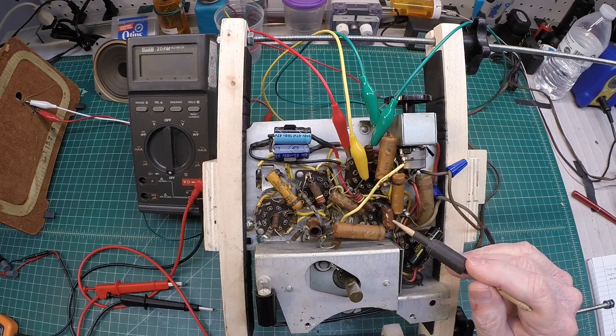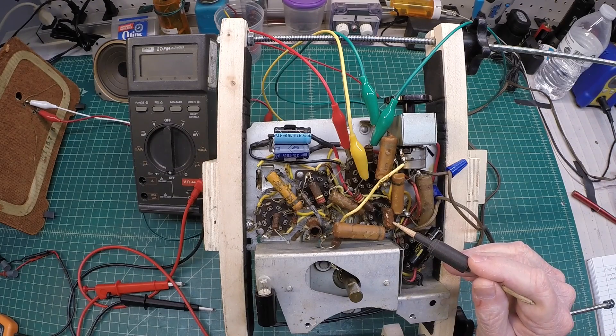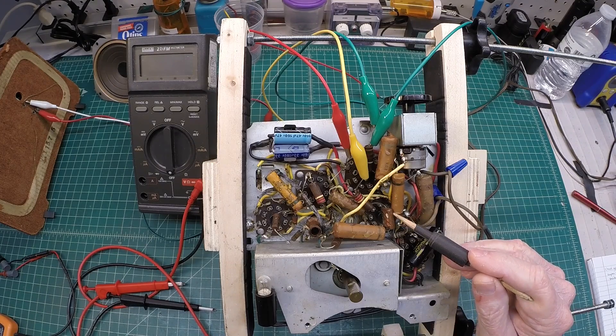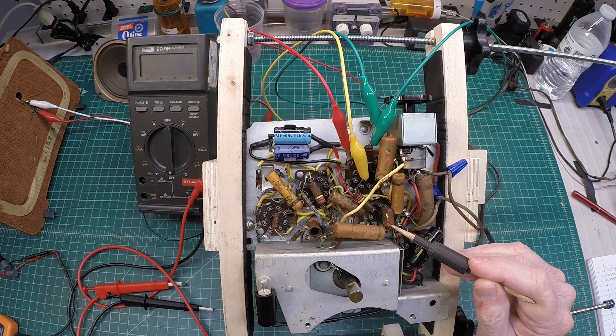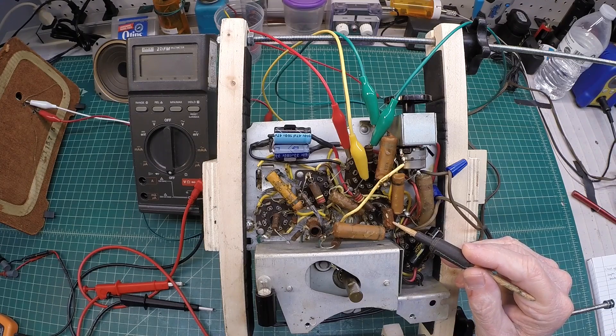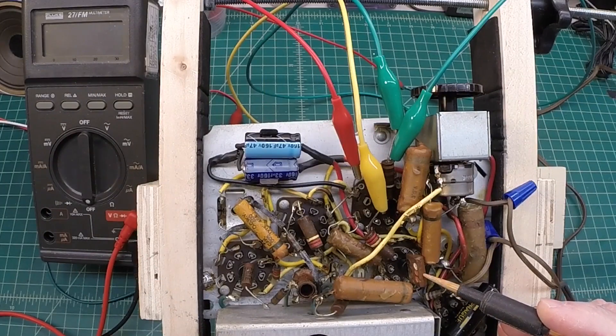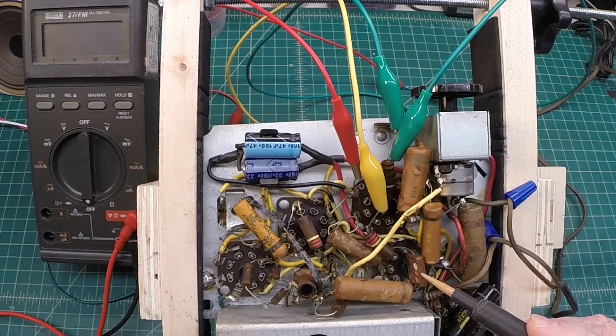If anyone has a better understanding of that capacitor, let me know. It's actually omitted on many designs. Also, from the Antique Radio Forum: in many cases this capacitor becomes leaky, intermittently passing 90 volts to ground. When that arcing occurs, there's static and noise in the audio — identifiable by turning the volume down and still hearing the crackling noise. And if this capacitor should short, since it's a bypass cap, we would actually be taking the plate voltage to ground, making the set inoperable.